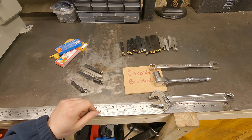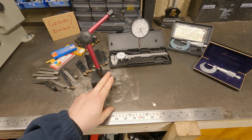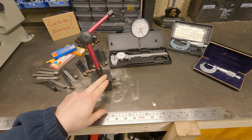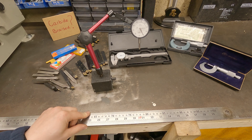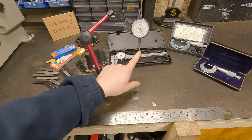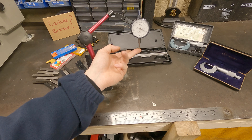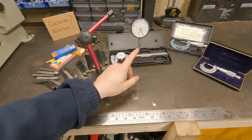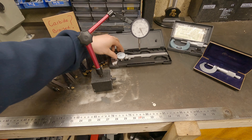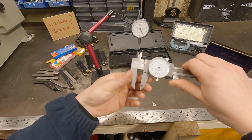Moving on, let's go through a few basic bits of measuring equipment you're going to need. I've quickly grabbed three different types of measuring tooling that I personally think you need when you first get into machining — specifically when you learn how to get things to a set measurement. This right here is a dial test indicator. It has a very high-precision tip on the end connected to a dial that measures up and down movement. This is really good for measuring runout in your parts and tools.